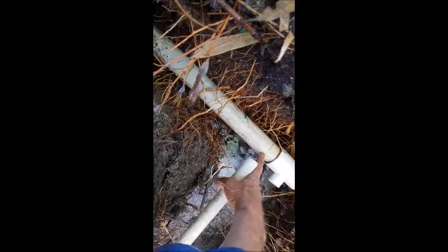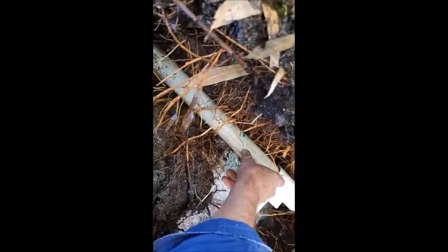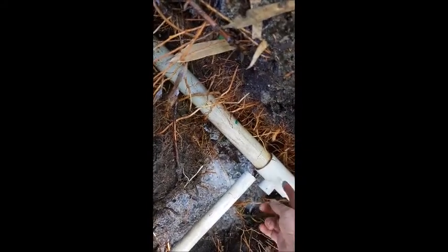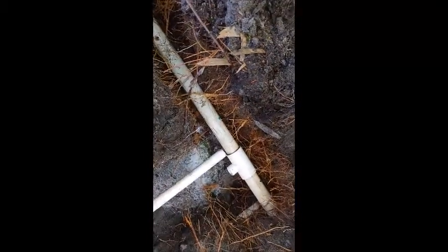This pipe broke from there — it's the wrong angle. So I'm going to put the T-junction here. This piece is too short; I'm going to add an extension to make it longer. I'm going to cut this off here and put a new one, going straight in. I'll have to put a 40 to 40 mil join there. That's the plan — I'm going to use a little grinder with a thin blade to cut the pipe.